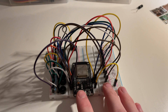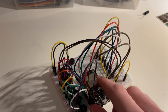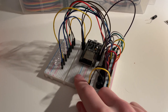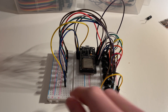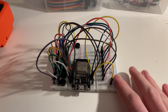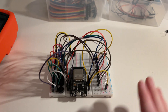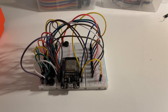I quickly threw together this circuit here. We have an ESP32 controlling the main sound part, and we have eight piezoelectric buzzers. Eight just happens to be as many PWM channels as these have, so eight is our maximum. And then we have some LED lights connected to these buzzers, so they will light up when they are making sound. Now we just need to make it work with a lot of programming.